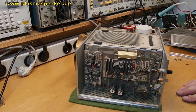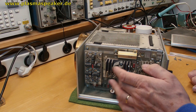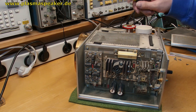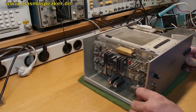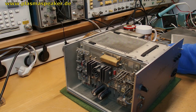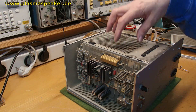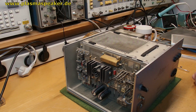Here is the main transistor which directly modulates our tube. The tube PL519 is inside this compartment here in the middle — it is totally shielded and we have to open this now to go inside the unit to the plasma cell and the tube.